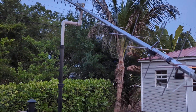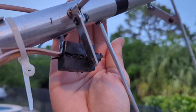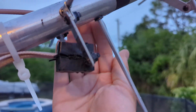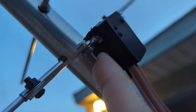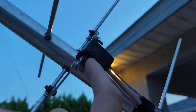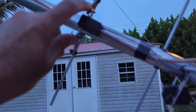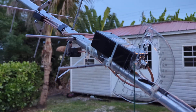Basically what it boils down to, I had a problem in this box. You see these feed points here? This one wasn't even connected inside. I had to take a soldering iron, heat it up and wallow out that hole, smoke it all to hell to get that piece in there and solder it. So now I have continuity on both sides of this, which was a problem. And I got the SWR down to about 1.2.